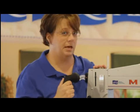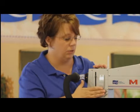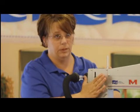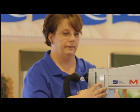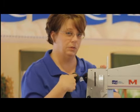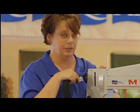It's a very easy adjustment for us to stop. If it happens to you, what you can do — this machine has a flywheel cover, but on the other side, if you were to put your hand against the flywheel when the machine is running with the positioner, put a little pressure on that flywheel. That will allow the machine to catch up and the circuit boards will stop the motor the way it's supposed to, so you don't have to worry about racing to the back end of the machine to turn the power off.